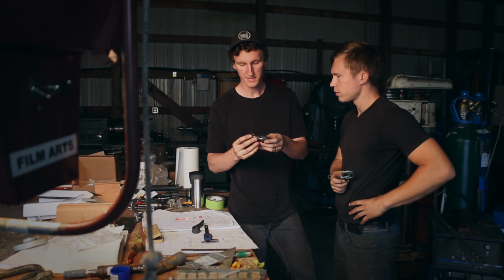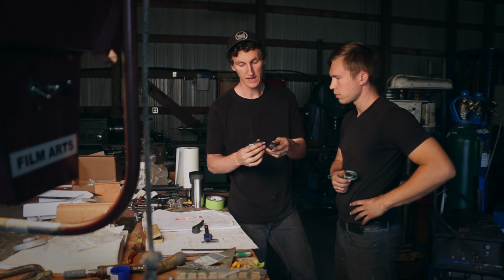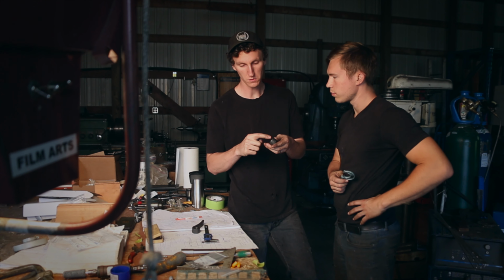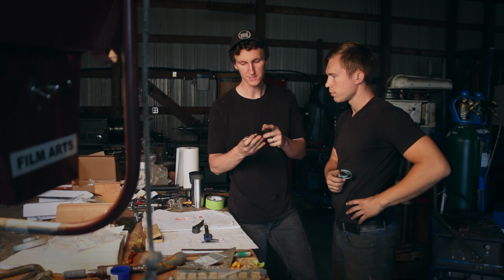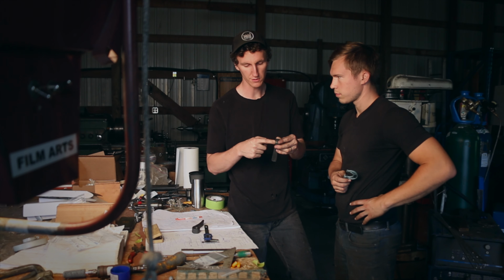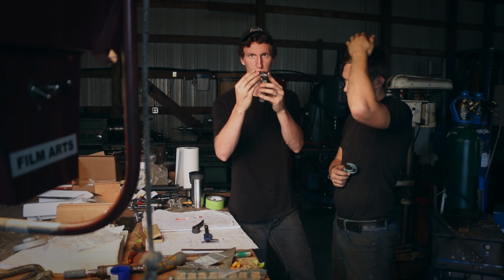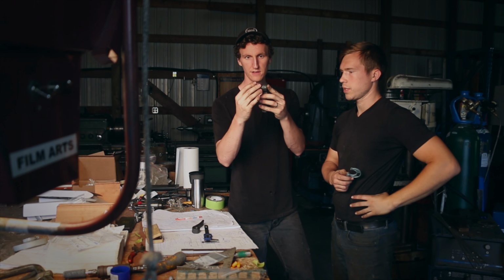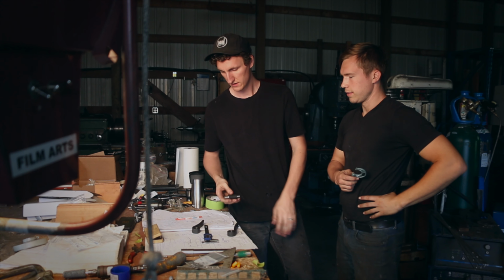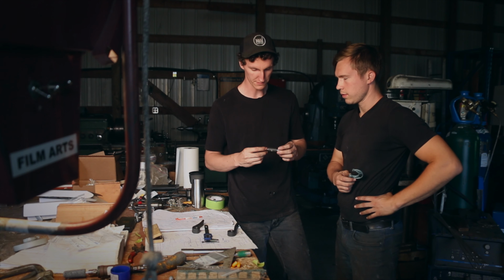So what's going on here is that I take responsibility on this one. I should have drilled this hole first and then got Martin to machine it to spec. I don't have a reamer, so I just used the 5/8 drill bit. And it is oversized considerably, so this part is now loose. This was supposed to sit together tight. So, I guess that's no fun. We're going to have to redo that part then.